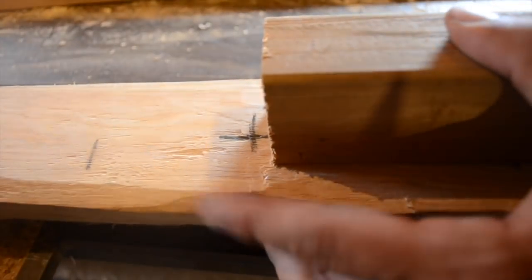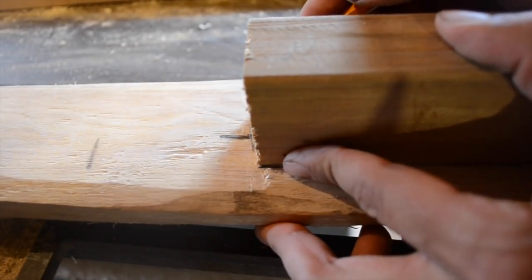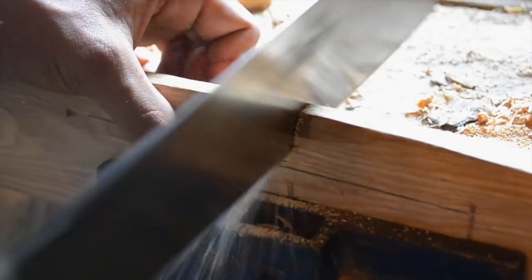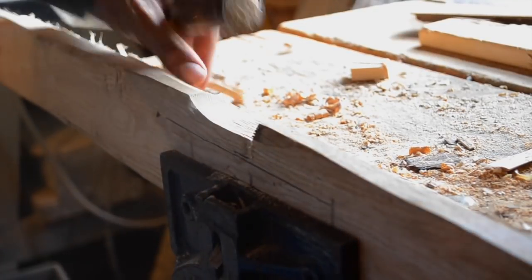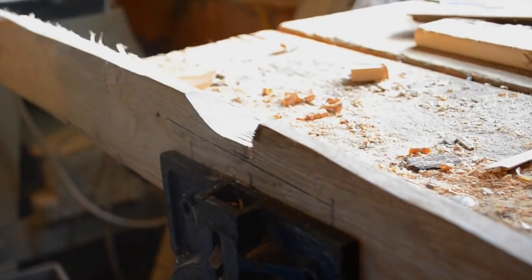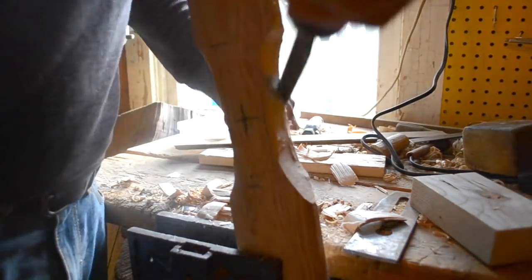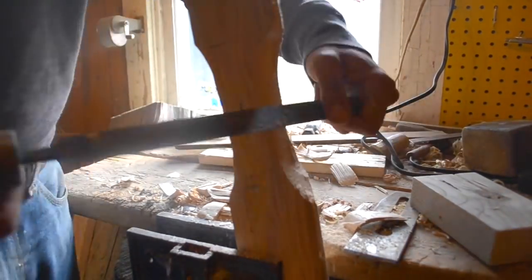Once you've shaped the rough outline it's time to work on the handle a little bit more. You want the handle to be slightly larger than comfortable to begin with — it's easy to make it smaller, it's hard to make it bigger. I'm making a single cut down the center to the desired width of the handle, and then I carve out the pieces with a chisel. I like the chisel a lot for this task as it not only works quickly but it gives nice rounded shoulders for the handle. Carving a bow handle with a draw knife is a real pain — I always tend to go too far. Once you've got all those pieces cut away, the rasp is a really good tool for roughing out the handle. Use the flat of the rasp when working on the handle proper, and the rounded section when working on the shoulders.